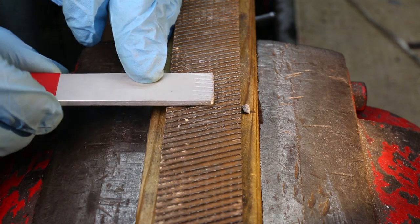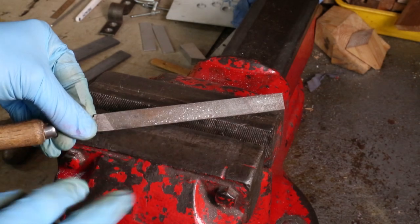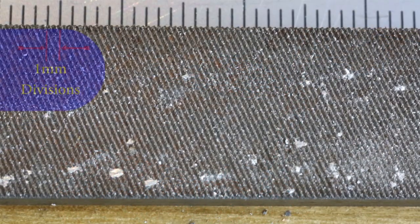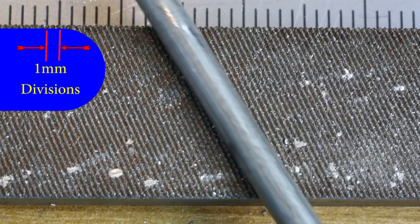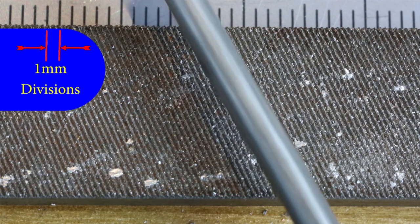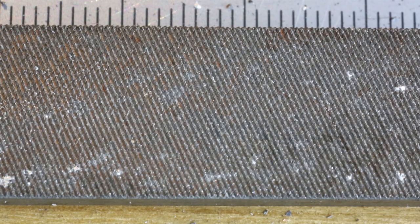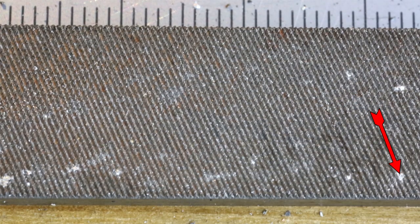This is the best method I think of doing that. This file has pieces of aluminium stuck in the teeth but it doesn't show up very well at this scale, so I'm going to come in closer and show you how we can get rid of this. Quite often to clean the file all you're going to need is a wire brush, but you need to brush it at the angle of the teeth, brushing backwards and forwards. If I grab the wire brush and brush across the file — you can see that most of the blockages have now disappeared, though we've still got some down here. So sometimes it's not enough just to use a wire brush and that's where this method comes in handy.